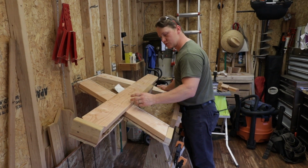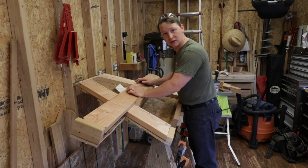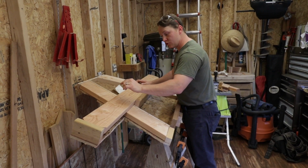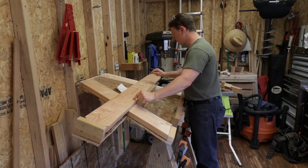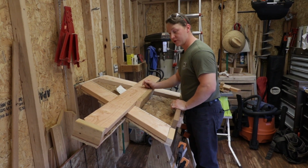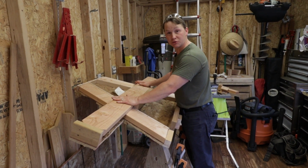And these two screws, they're about 1 inch down from the top, and they're in a straight line because it looks good. The two bolts that we place will be at a 45-degree angle, about 1.5 inches into the material, and that'll give this a solid basis to rest.